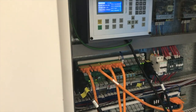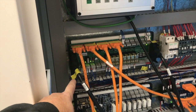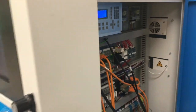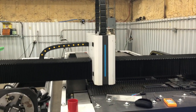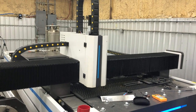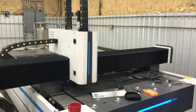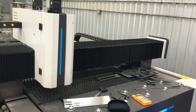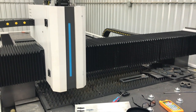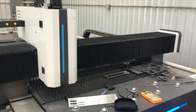The moral of the story: if you've got a board like this with a bunch of stuff connected and you've verified your input source is good, the next step is to disconnect everything except the input source and see if it powers up. I started my career in IT troubleshooting PCs and printers for HP, Compaq, and IBM — that was always the first thing you did. Shout out to the Prima engineers in China for helping me troubleshoot and for sending the replacement board out, even though that didn't end up being the problem. We're back up and running — thanks guys.